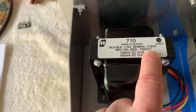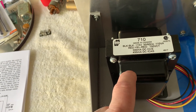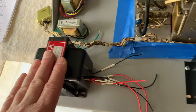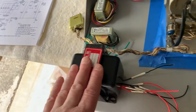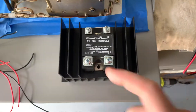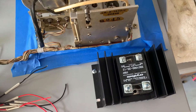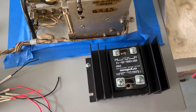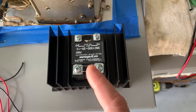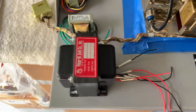So I should be able to regulate this down to 370V, 275V, and plus 150V. I should be able to use this one for the negative keep-alive, the positive keep-alive supply for the negative limiter. That circuit will all be here, and the wire will come from here to the limiter to power it up. When I key PTT to transmit, this will come up — it'll be the fastest thing that comes up in the transmitter because it's all solid state — putting the voltage right there before the plate supplies fully come up. So that should be perfect.